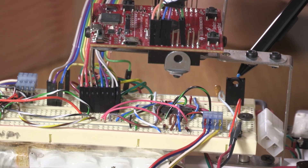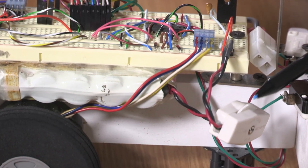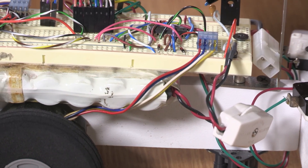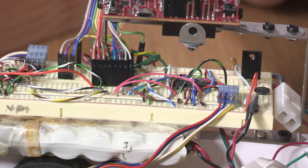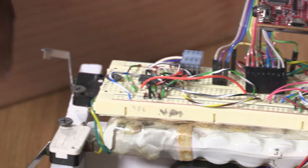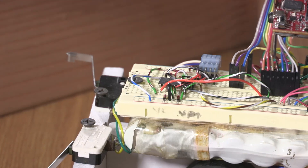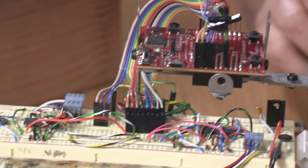This black chip here is the regulator, which takes power from the battery — the 8.4 volts — and generates 5 volts out to power the launch pad. The two sensors are connected to port E pins 1 and 0, and the two stepper motors are connected to port B.